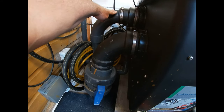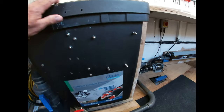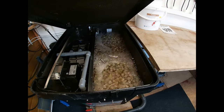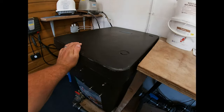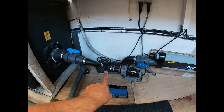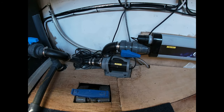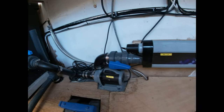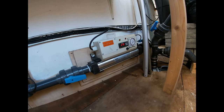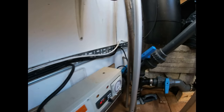You can see there the overflow on the waste pipe goes there, which goes back down under there along here to a drain off. I'll explain the drain off to you later. Water comes out of there through an inch and a half bore valve down to sweeping 90s into pump one, which is a Pondexpert Veriflow 20,000. That goes then through the UV, through the heater that's set at about 18 to 19 degrees — though you can see the temperature is 21.9 so that's not actually running at the moment. Then it goes out the wall.